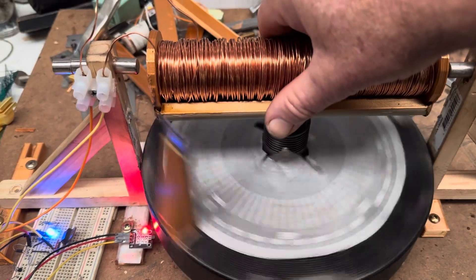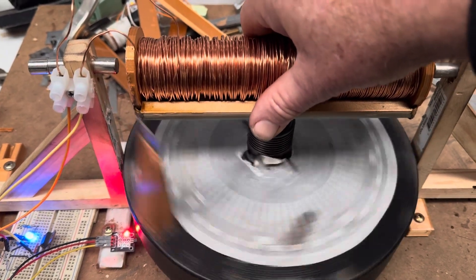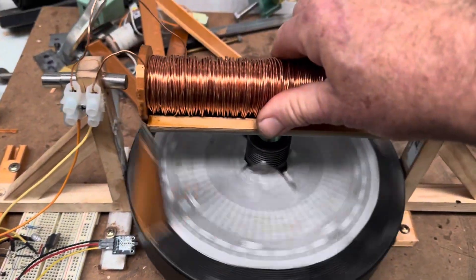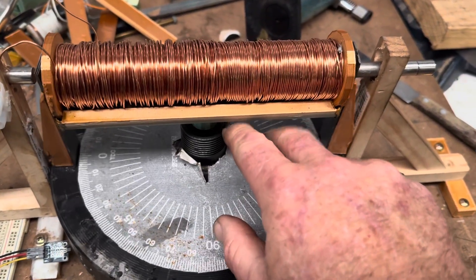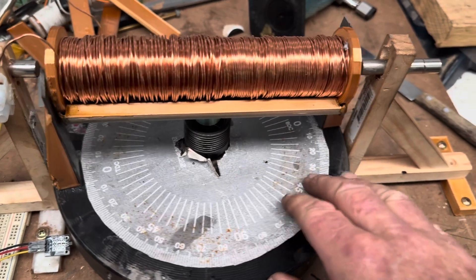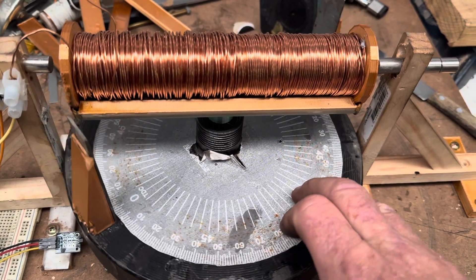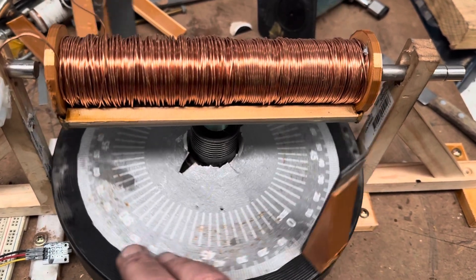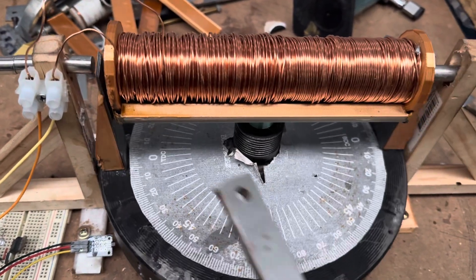As you can see, there's a bit of movement and a bit of noise. I have to glue this one down, but this is about 1600 turns of one millimeter wire, with magnets opposite poles facing in.